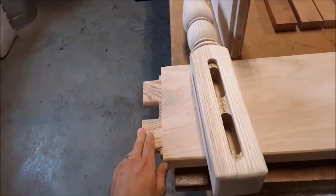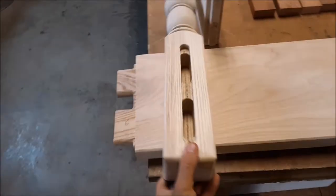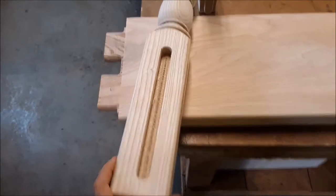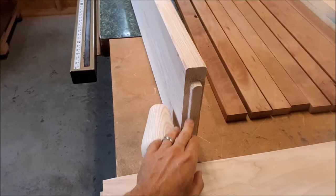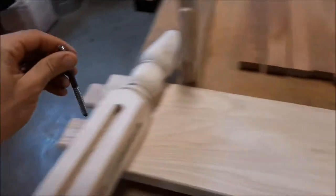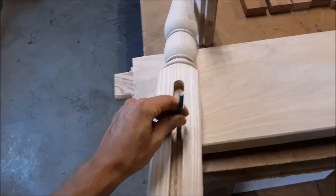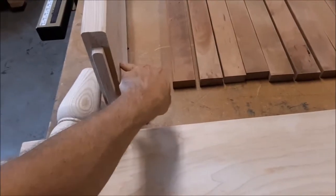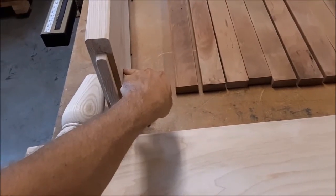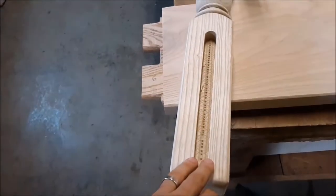The customer is requesting no glue in the project at all, so I've got to think outside the box. There's also a shallow mortise here to mate with the stub tenon on the rails. In the middle, I'm going to do a hanger bolt — it will protrude out from the mortise, then I'll drill a hole through, and do a relief hole on the side for access to the nut, which will clamp it tight against the leg of the bed frame.